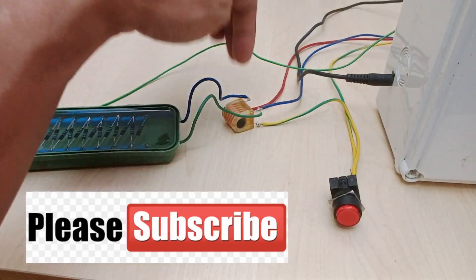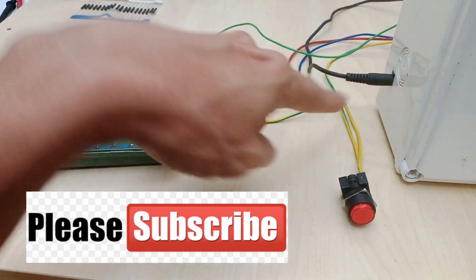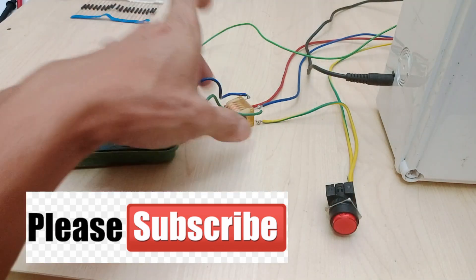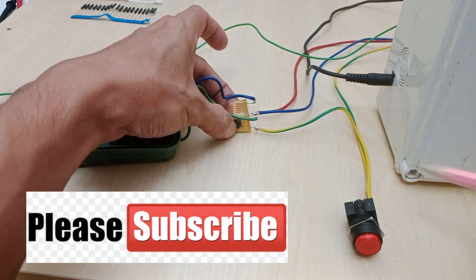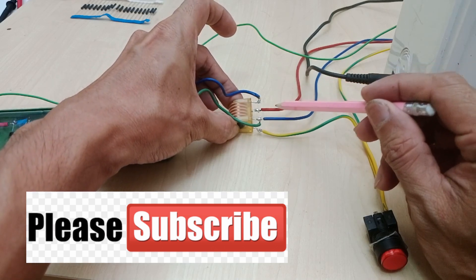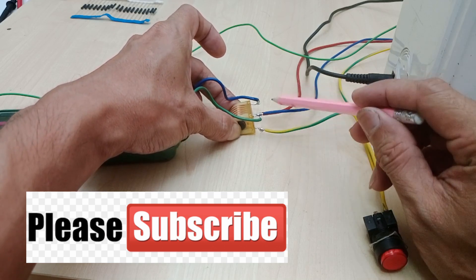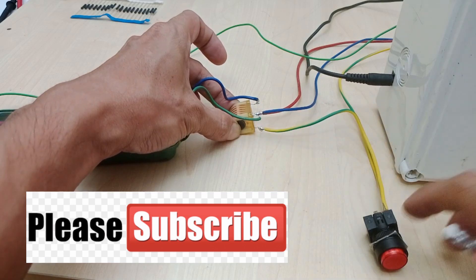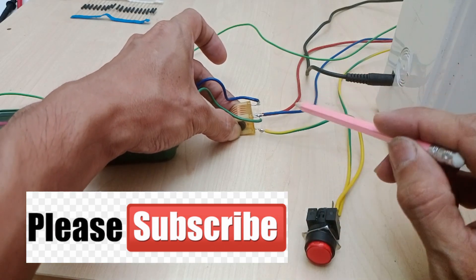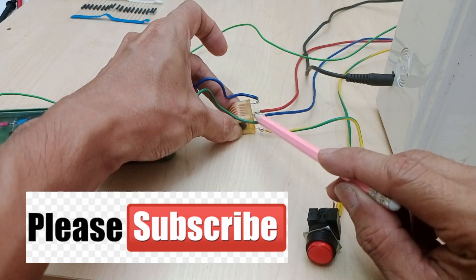The cable that goes to the powder coating gun has three wires. One is the ground wire, which goes to a switch on the gun trigger, and that switch cuts off the signal to the high voltage cascade connected to the primary winding of the step-up transformer. The red wire is connected to terminal 7 on the PCB, which is the output of the oscillator. The ground wire is on terminal 6, which is in series with the trigger switch. The blue wire is the microampere feedback, connected to the secondary wire and to terminal 5 on the PCB.